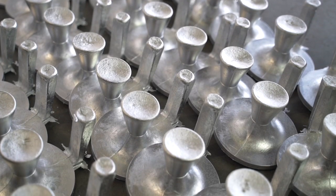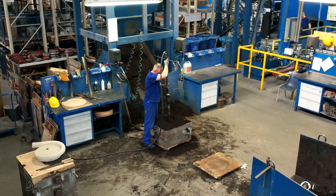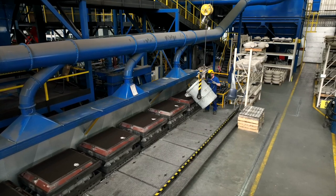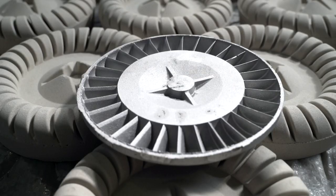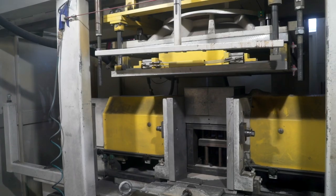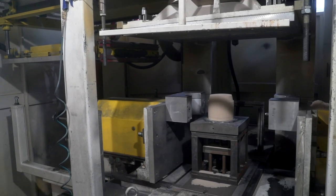In this case, the rotor hub. The second method is sand casting, which can be done manually, but also with the use of automatic moulding lines. Firstly, cores reflecting the casting inside must be prepared. They are made of quartz sand, which is fed to the press and hardened under the pressure of 250 atmospheres.